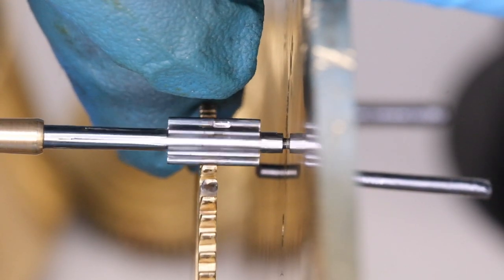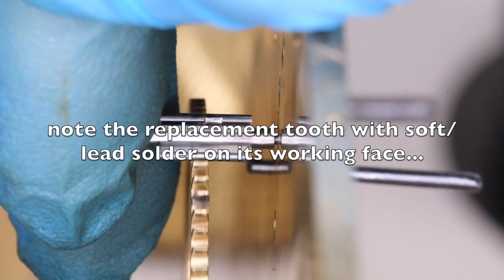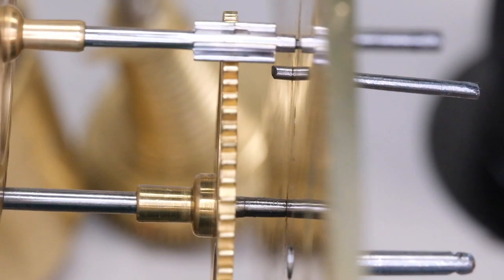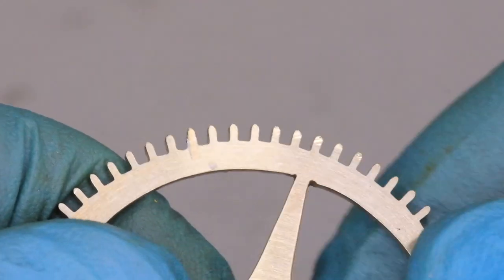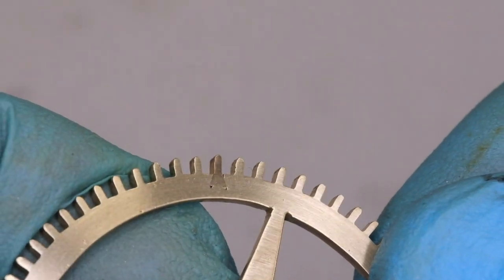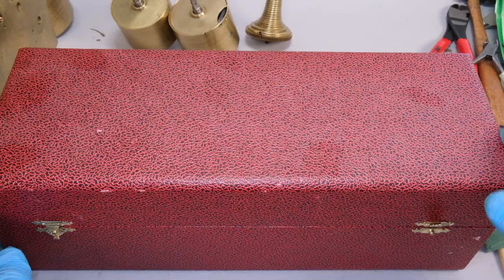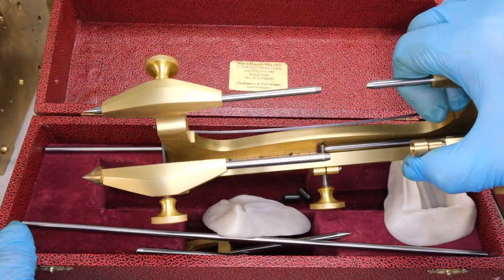So in fact I did have to go back and remount that wheel and get it concentric again. You see I miss spinning the wheels, and the wheels seem to run fine, but unfortunately spinning the wheels very rarely gets you anywhere — you have to test them under load. If you think the mesh is uneven or jamming at all, it's best to take the wheels out and put them in the depthing tool. Looking at that third wheel, I can see there's a let-in tooth here — actually there are two let-in teeth. This one has been dovetailed and done quite neatly; the other not so neatly, but it doesn't bother me if the depthing is fine. The wheel has been refinished, which is a bit of a shame, but that's 20th century practice I suppose.